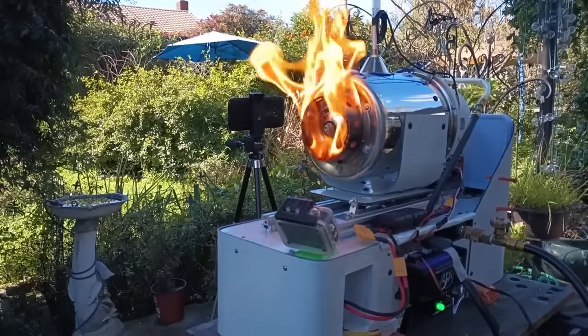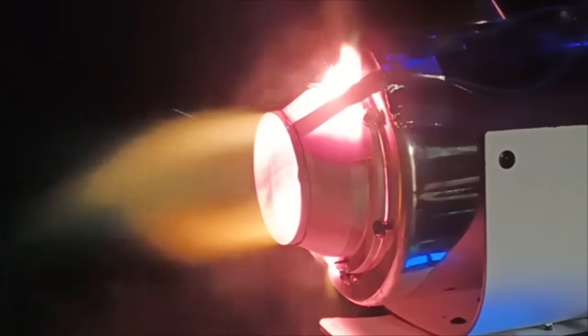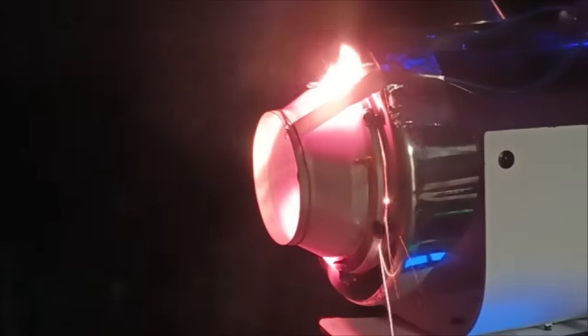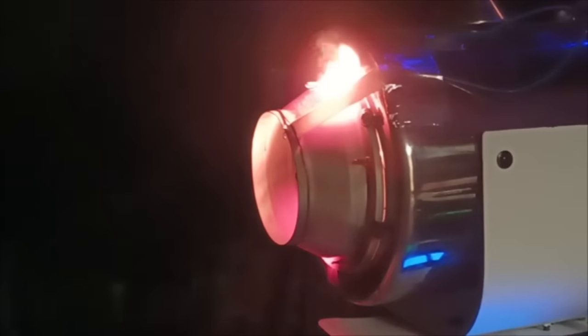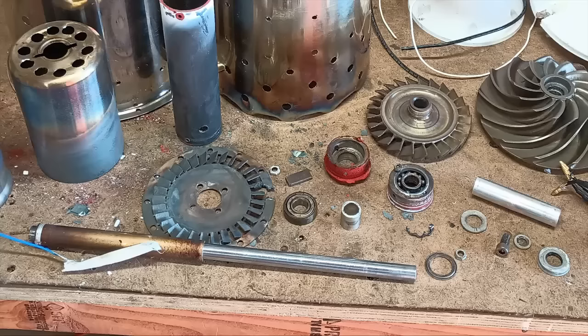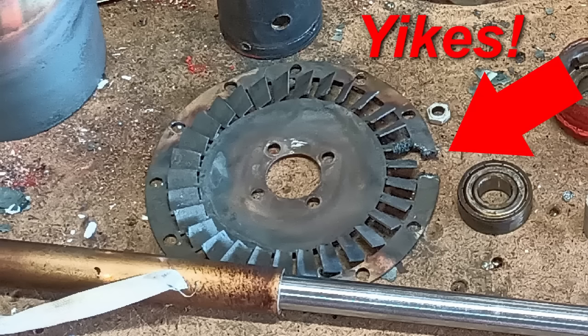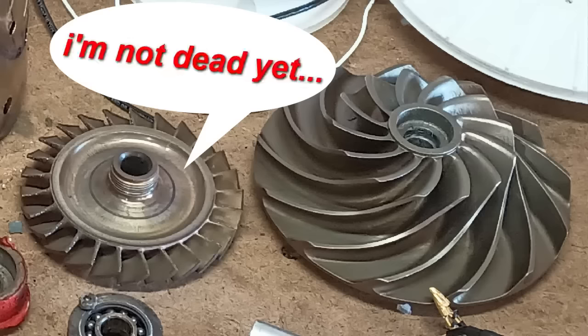Still, not everything went well. There were several hot spots that leaked near the new nozzle, and the mild steel nozzle itself quickly oxidized. This oxide flaked away, making sparks in the exhaust and weakening the nozzle. What finally ended its last test was the damage to the stator and bearings. The rear bearing was completely seized, and the stator was so oxidized that it was missing a couple of guide vanes. This rendered the engine inoperable, but probably saved the turbine wheel, which would be harder to replace.